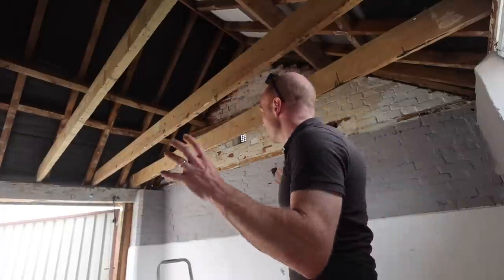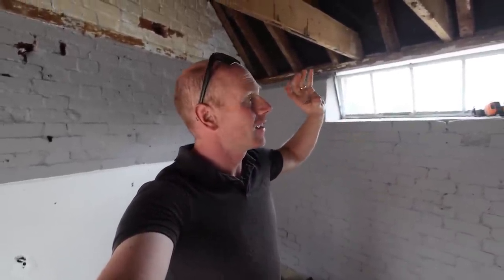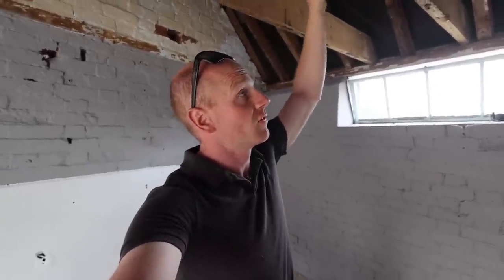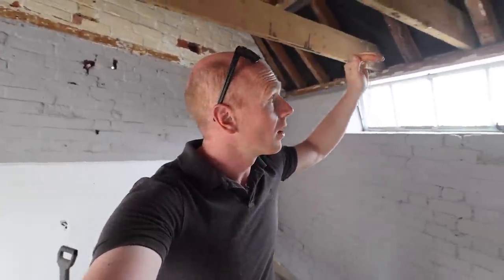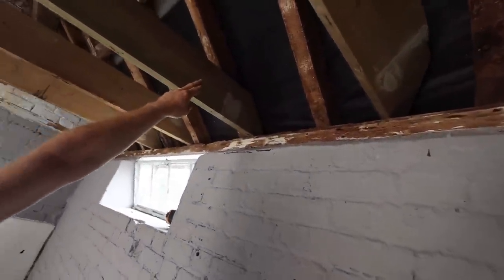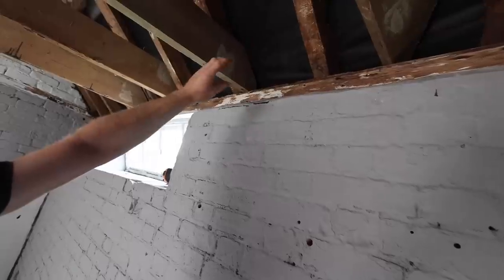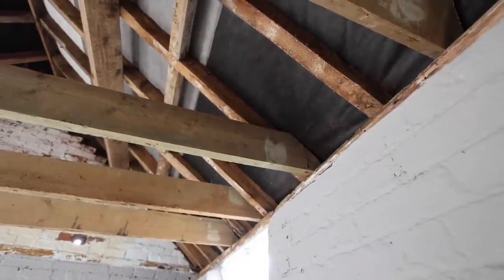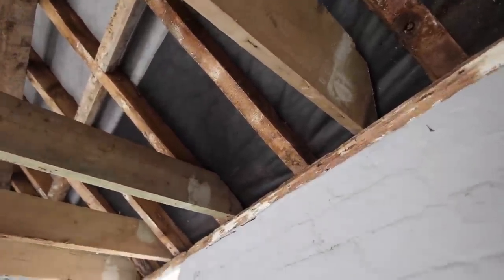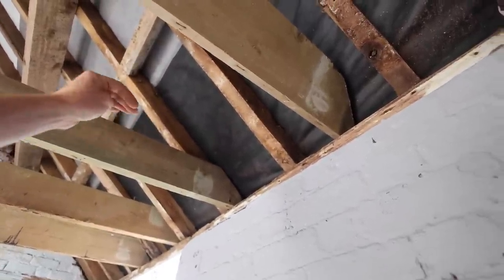Back from school sports day and I've been thinking more on this ceiling. If we go for the idea of putting plywood on top with feature beams, we need to account for the fact that when the plywood hits the rafters at this height there'll be an exposed bit of angled ceiling. It won't be quite as simple as going wall to wall - it just means probably an extra hour or two putting battens and board across, and I probably won't easily be able to insulate in there.